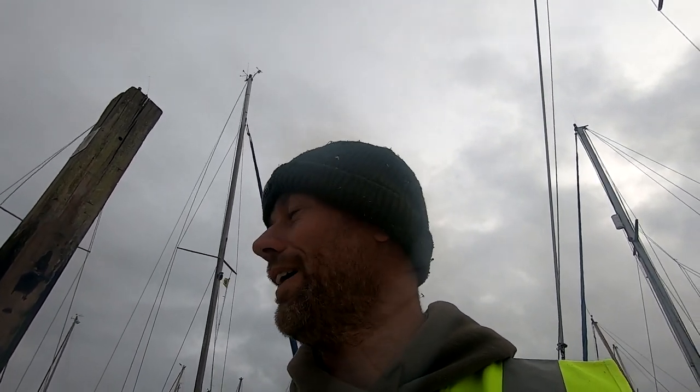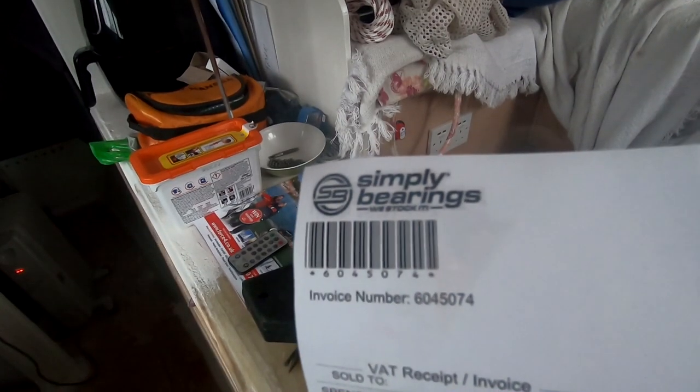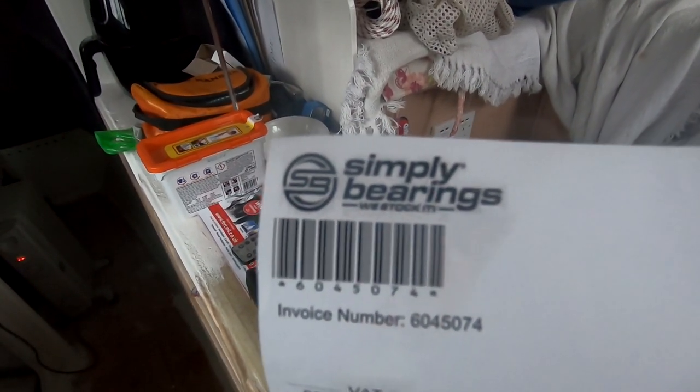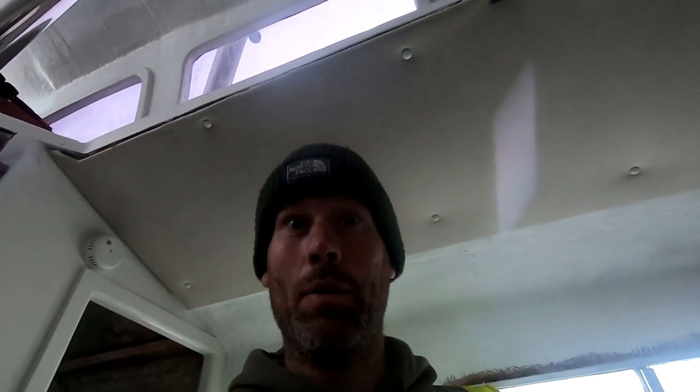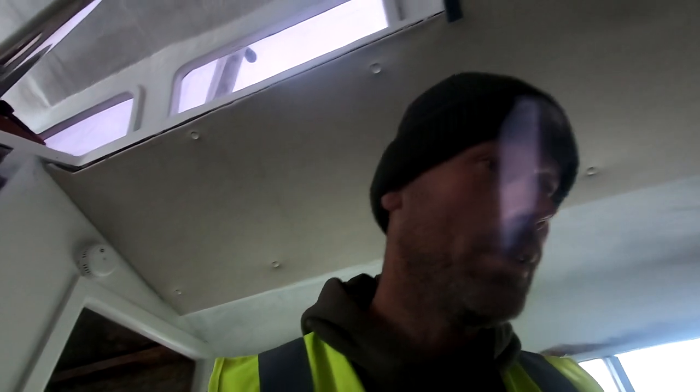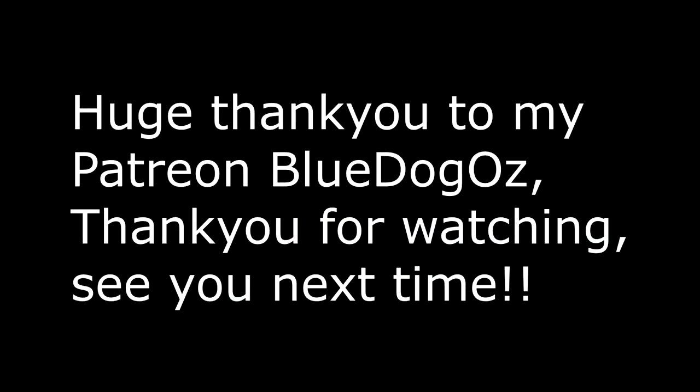Simply Bearings - three-sixteenths and one-quarter inch - delivered, total £28.18. This is 2022 so if you're watching this in 10 years time prices may have changed, but if you're thinking about doing this job and your furler is getting a little bit tight - there you go - about 30 quid, a bit of margarine, and good as new.